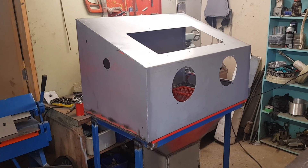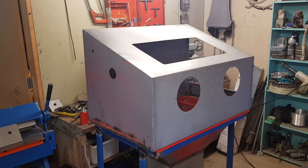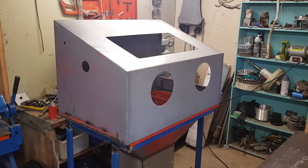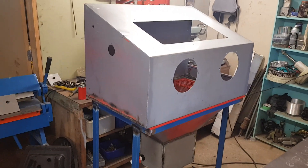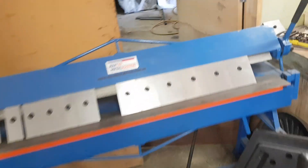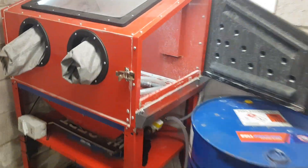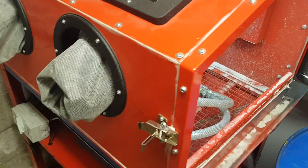The final one I think was from Richard and he asked why not just agitate with the air. It's quite possible to do it that way. The reason I've never bothered was purely because with the smaller compressors — you can see a couple in the mess there — you're using all the air for blasting and I don't really want to divert any of that away for agitation when I can use an electric pump and save the air for the blasting.